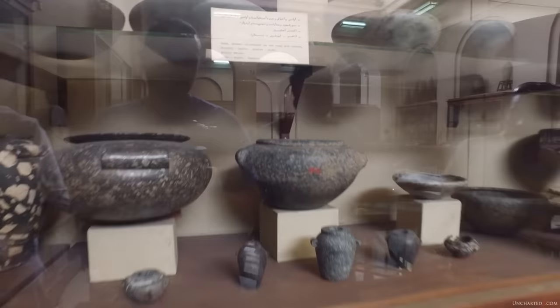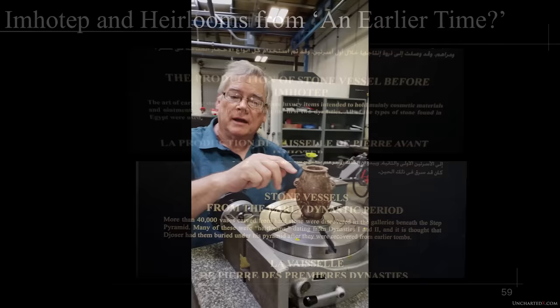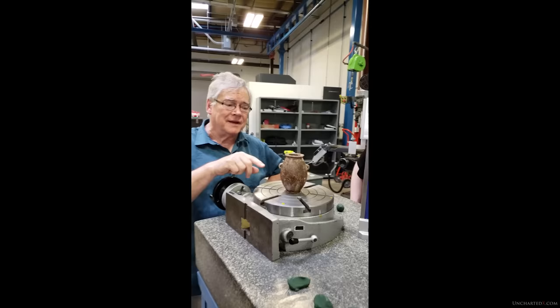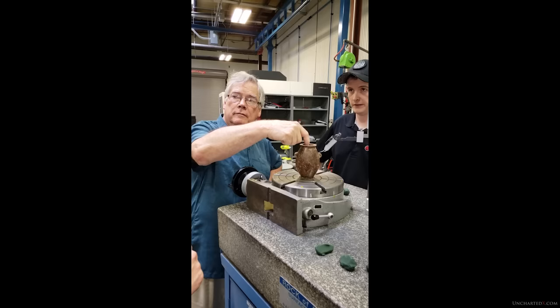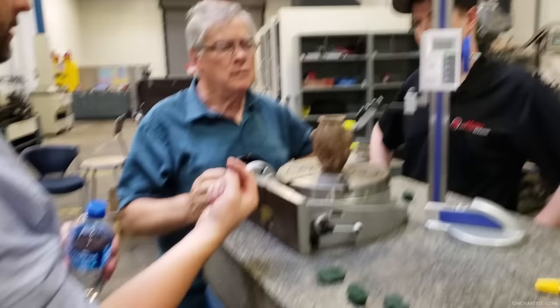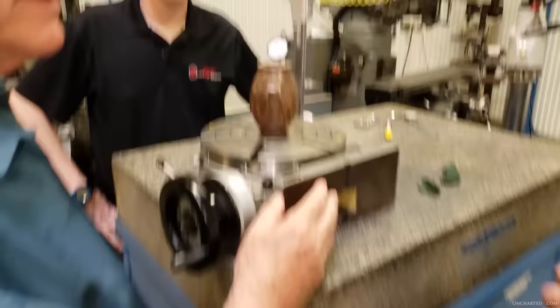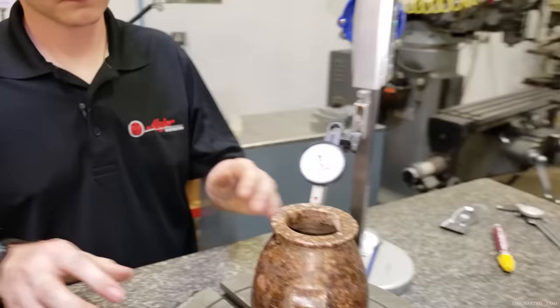Mainstream Egyptology also acknowledges that these were inherited objects, collected from even older burial sites. Returning to the vase in question, let's for the sake of argument assume a turning process like a precision lathe was involved in its manufacturing. The features that cannot have been made via that process are the lug handles themselves and the area of the vase body between them. If it was turned, then a bullnose or ridge had to be left all the way around the vase in the general shape of the lug handles, and then a different machining process must have been used to carve out the two handles from this ridge, as well as the area between them.